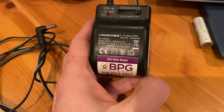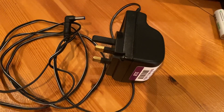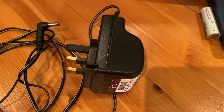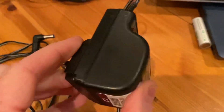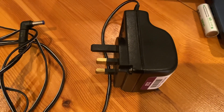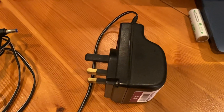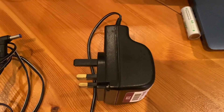Now some of these adapters won't come with the Class 2 logo on them, so some people might think they need to treat it as a Class 1 appliance. If you go through the same logic and attempt to do an earth continuity test as you would on a Class 1 appliance, again there are no exposed metal parts — it's fully encased in plastic. You can't do a Class 1 test on it. The telltale sign is you've got a plastic earth pin, so there's no way your machine is going to be reading for any earth leakage. Again, you can't do an insulation resistance test because there are no exposed metal parts.